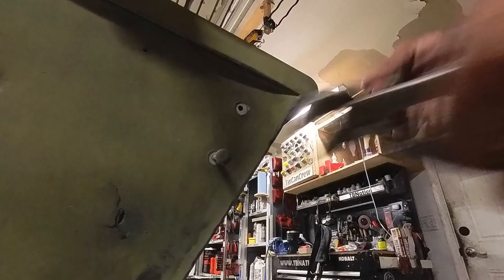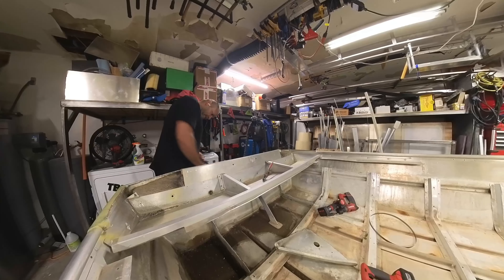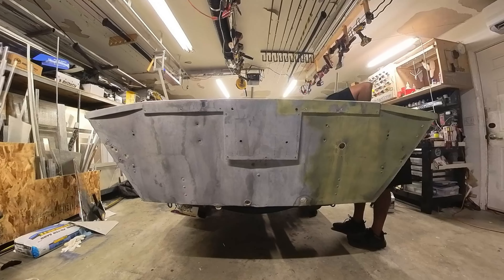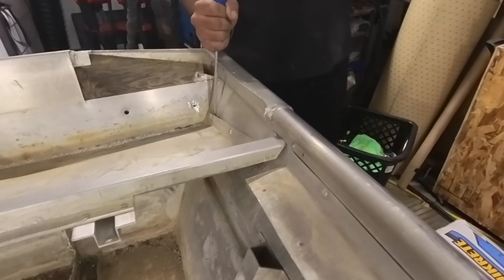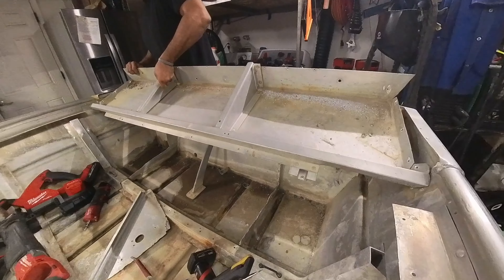These rivets are a little odd to get out but they do come out with a little bit of force. We developed a kit to retrofit old bass boats like these, and a lot of what was done way back just won't work. The splash guard concept — while appreciated for draining water over the back of the transom — has better alternatives now, and getting rid of it actually adds a lot of space to the back deck. You might also run into solid buck rivets, which are the permanent bonded rivets holding most of the hull together. Grind the ends off when they're bonding two pieces of metal, then slowly work and pull that off. You can later re-mushroom the rivets — even though shorter, they don't need to be as long once you've removed that piece.